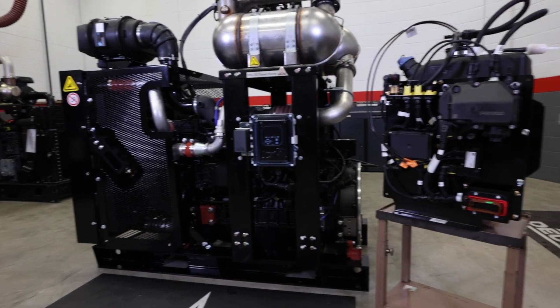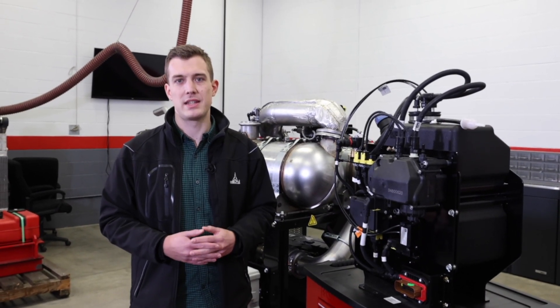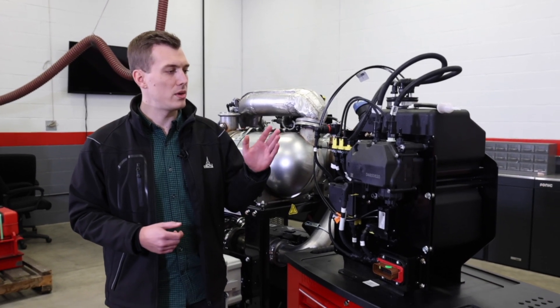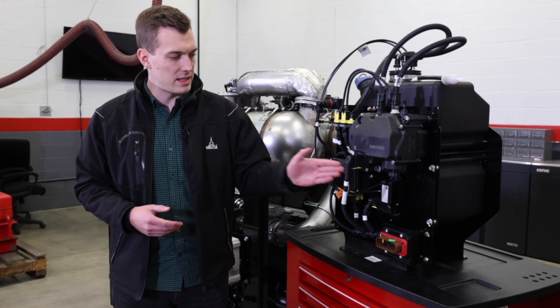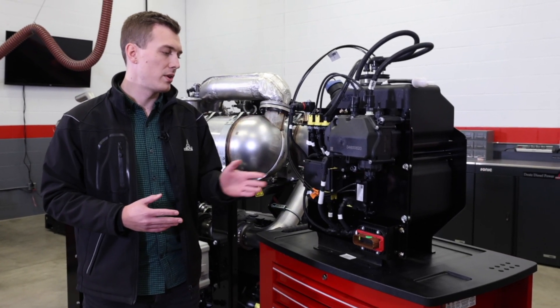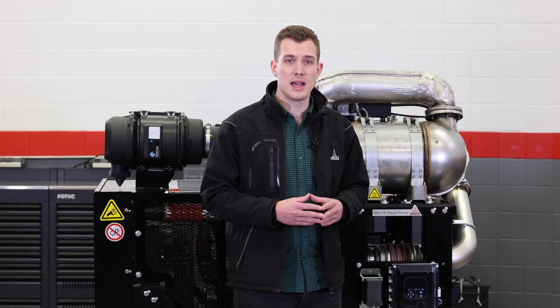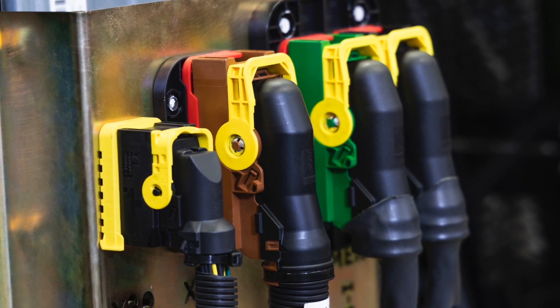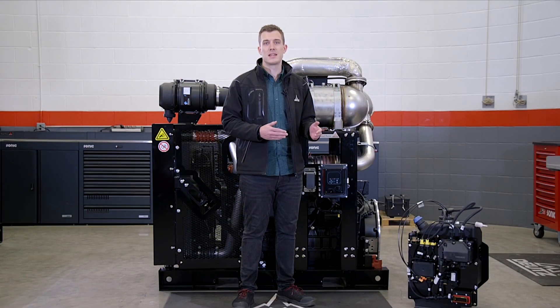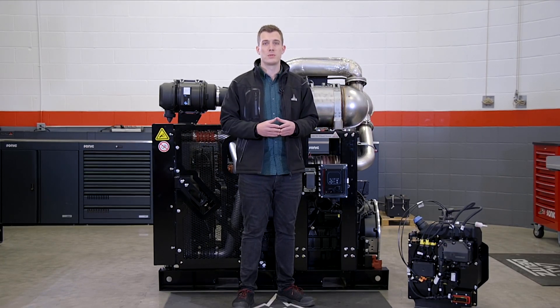Next up, the highlight of the new modular concept: the brand new diesel exhaust fluid tank, or DEF tank. It includes all necessary components for the DEF system, including the DEF dosing module, the DEF level sensor, the DEF heating valve, but also our brand new relay box. The new relay box is way smaller and includes solid state relays that increase efficiency and reliability. This module is required on all engines above 75 horsepower and it's the same exact design between all engines — 3.6, 4.1, 6.1, all the way through 7.8.